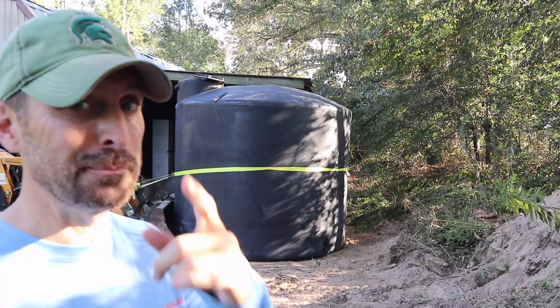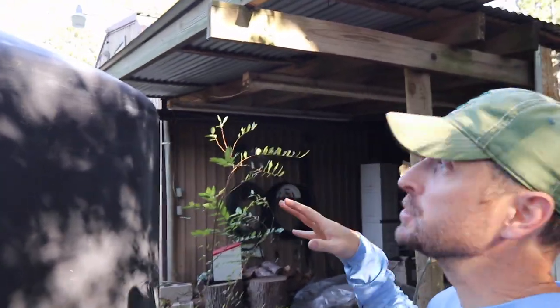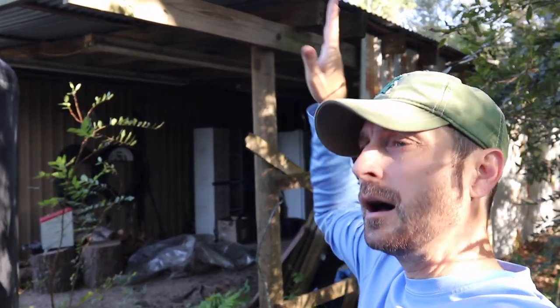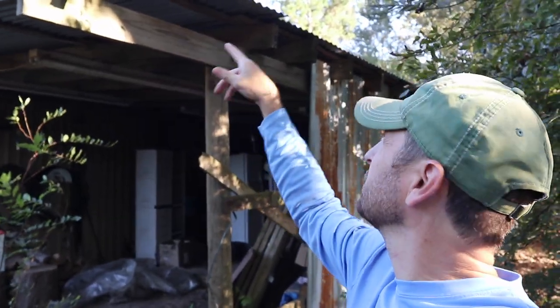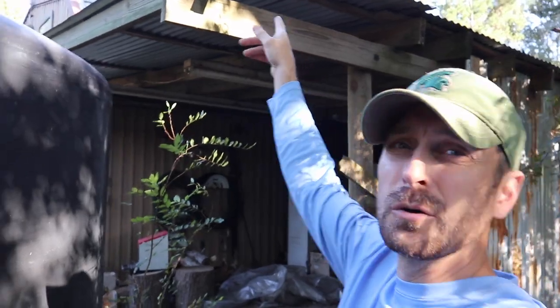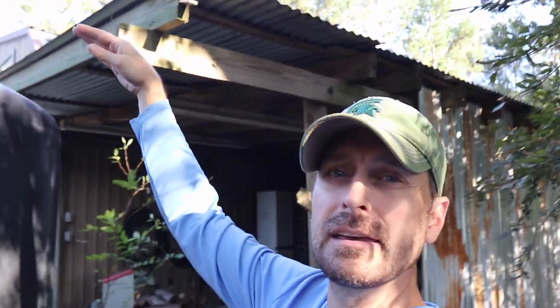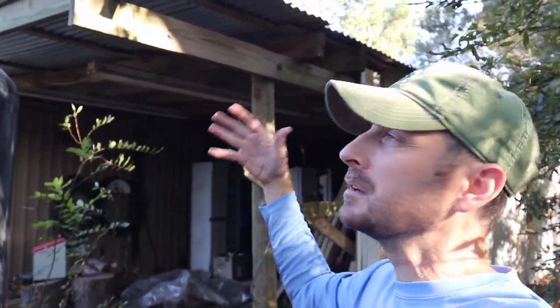That little trick worked well — thanks Pete from Pete B. Homestead. We got the tank positioned somewhat where we want it, but I might need to make some adjustments. You can see the ends of the rafters right up there — that's where our gutter is going to hang off of. I'll probably put a fascia board on that so it's easier and cleaner for the gutter to hang, instead of just putting it on the ends of those rafter tails. The old owner had one up here, as you can see from the old bracket. We are above our tank, so that is good. I dug down maybe six inches when I flattened this out, but I might need a little bit more. I have to get all the parts and pieces — that'll be the next video for you guys in this series. If you're interested in that, stick around and subscribe.